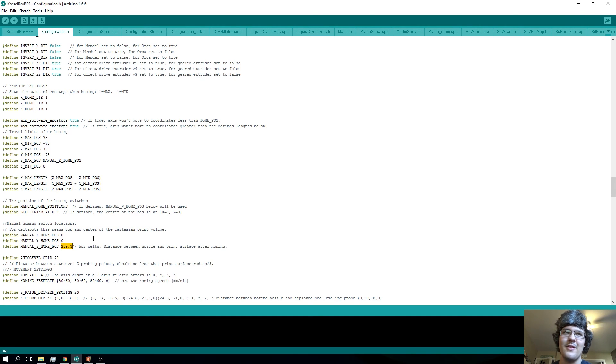I'm not going to redesign it because I'm fine where it is — I don't print very tall. If you put everything at the very max that you're able to do with this kit, you're going to need somewhere in the neighborhood of 315 millimeters. So for example, I'm just gonna put 315 right here. All the other settings — watch the other video. Just put something like 315 or 320, somewhere in there, and we know that's going to be bigger than what it should be. This is in millimeters — this is the variable from the tip of the nozzle down to the actual build plate itself.